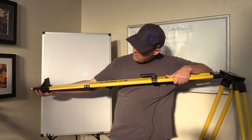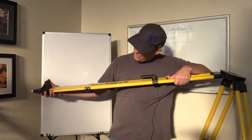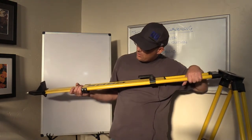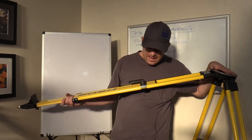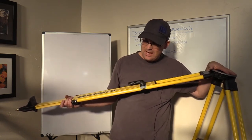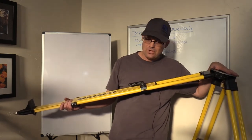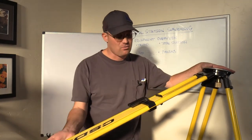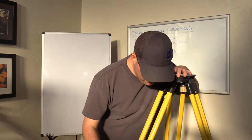At the end of the tripod leg, there's usually some kind of foot with a pointed tip and a peg that you can use to push the leg down into the dirt or the pavement. You want to do that because you don't want your total station to settle after you set it up — you want to compress the surface ahead of time. If the tripod settles, your gun can get out of level. That's become more important as the instruments get heavier; robotic total stations are quite a bit heavier.